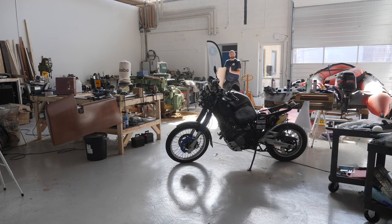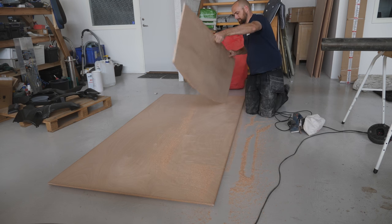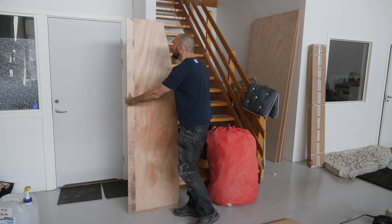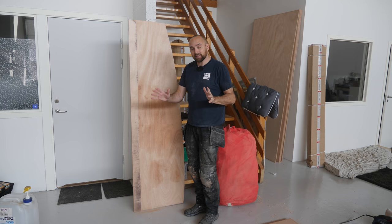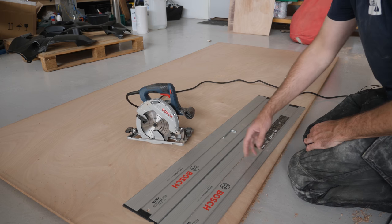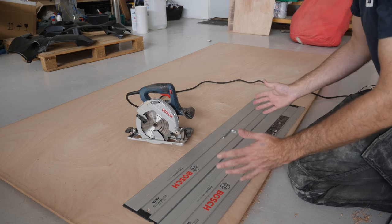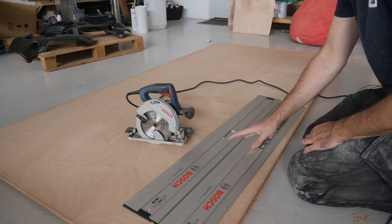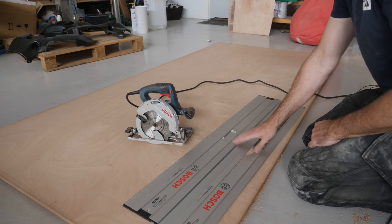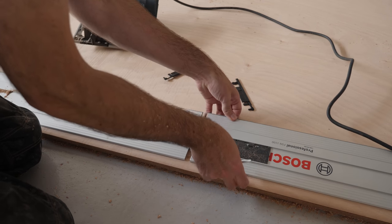Welcome back to the workshop. I've brought along the piece of the cabin sole I've already cut because I'm gonna prep this for a glassed butt joint. I'm hoping the glassed butt joint will be okay for joining these two pieces together, because that way I'm not losing any storage underneath the cabin sole. For cutting these long pieces of plywood I've purchased a circular saw with a track. The track is more a convenience thing here, but it's gonna come in very useful when I start to curve plywood to give me nice radiuses. And with this handy clip thingy, you can join two tracks to form a much longer track.